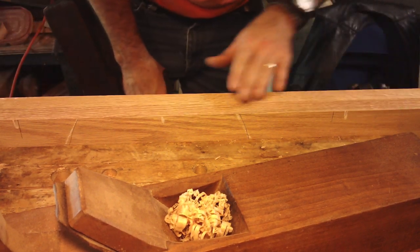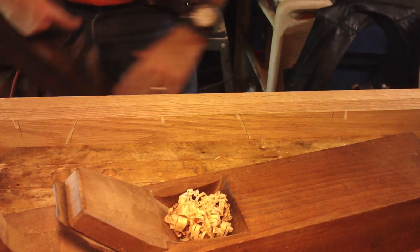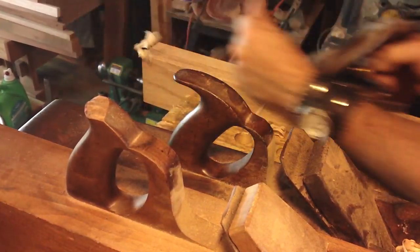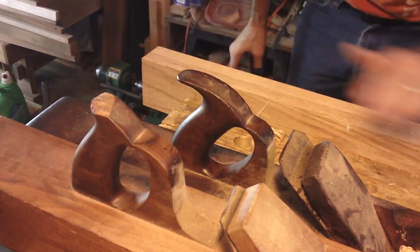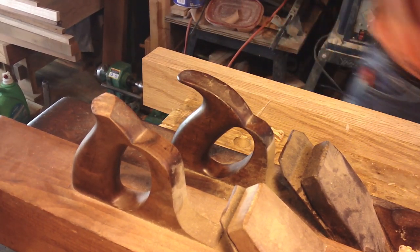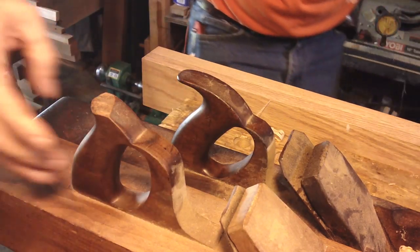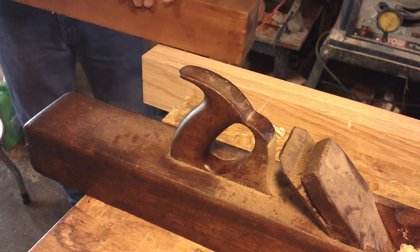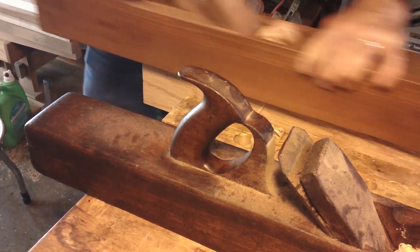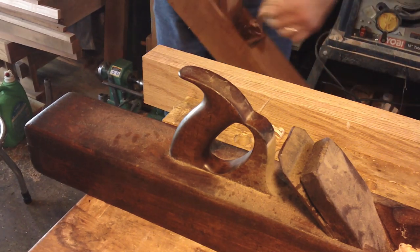All right. All my chalk is gone. There we go. Bevel on this end. And that should create a little taper on that side and a little taper on that side for me. But for general principles, I will take the large joiner and run back over it. Try to get some inconsistencies down.